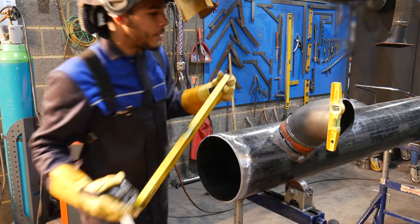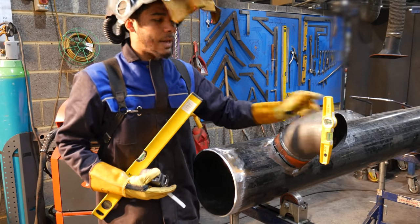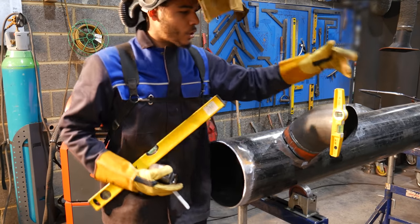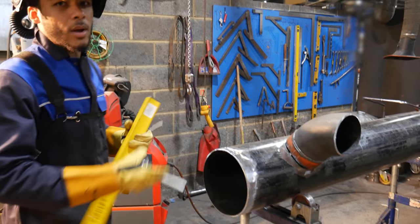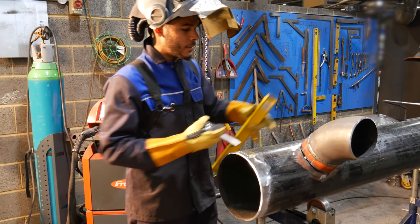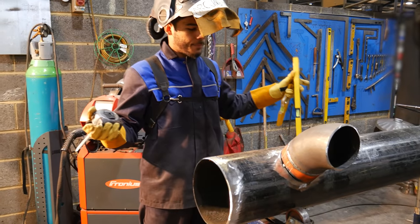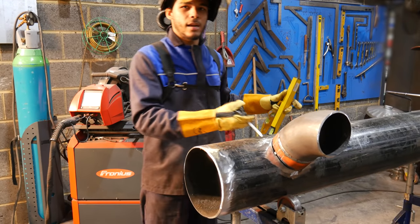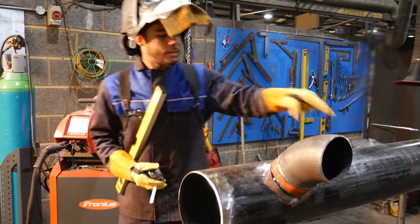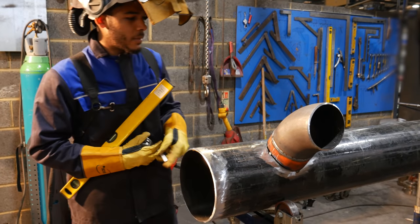We ran out of 45s, so we ended up chopping a 90 degree elbow, which is why this chop may not be perfect. I'm happy with this — now I can weld this up and then put the flanges on. The reason why I'm putting the flanges on last: when I was putting on this square branch, nothing was dictating the level of it. I could just put this on how I wanted, with the gaps that I wanted, and then next I can bring it to the right level, then put the flanges on, and I know everything's going to be bang on.